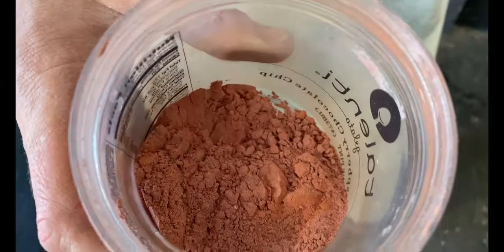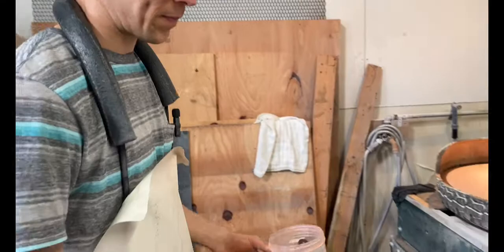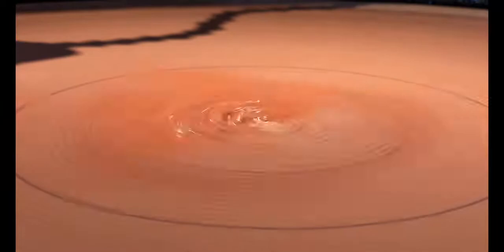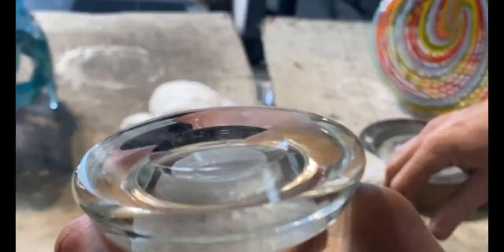This is cerium — a rare earth mineral used for the final polish of the glass. It's pretty expensive; I think it's around a hundred dollars a pound. I bought about five pounds ten years ago and I've used about two ounces — it lasts a long time. I like to get the cerium saturated in the water right in the center — just put about a teaspoon or couple teaspoons on there and let the water drip on it to get it saturated. That way the cerium keeps spinning out all over the wheel. You have to watch out for the glass getting hot, which is why I use a lot of water and I'm always feeling the bottom.